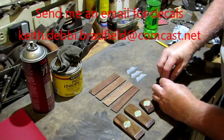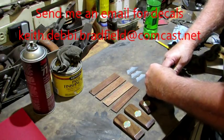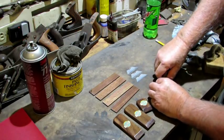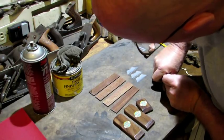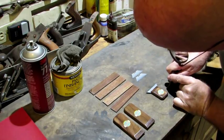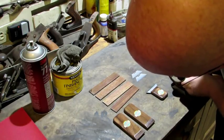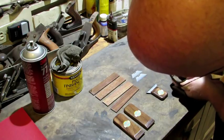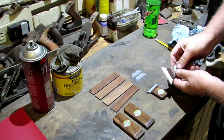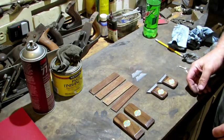The next thing you want to do is get your razors lined up with the slot centered — try not to remove your fingers. Press your scrapers down until the notch is seated all the way to the bottom. Once they're in, if you decide you want to adjust the center, put them on something solid and tap them with a hammer, because the tight saw cut holds the blade. That one's just a little bit off center but that's good enough. There's a look at all four of the blades inserted.